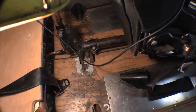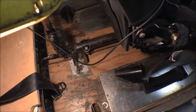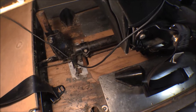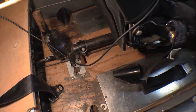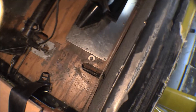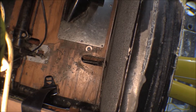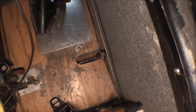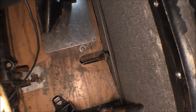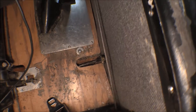I made a plate in there behind that standoff — that bearing for the torque tube — to cover up that hole. And this is something I didn't put in there. Those things weren't there on the new fuselage; they made a mistake and didn't put them on there. But that's the aileron pulleys — lower aileron pulleys. The brackets didn't get welded on that new fuselage.